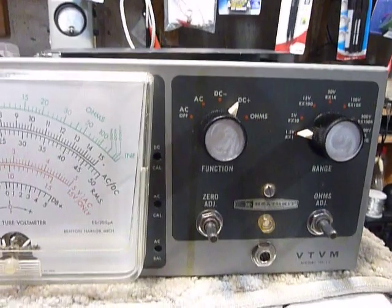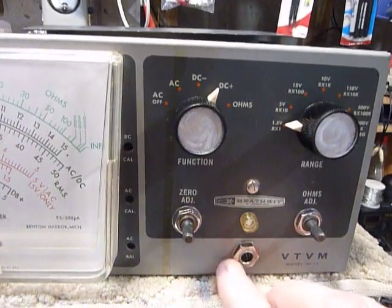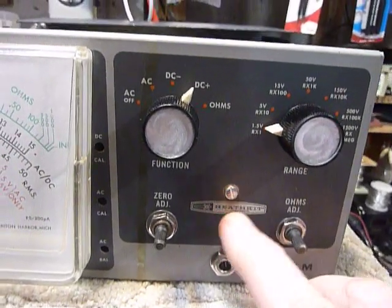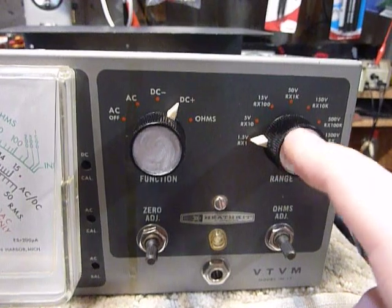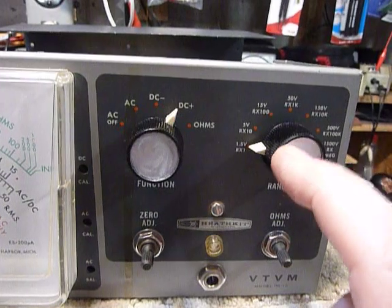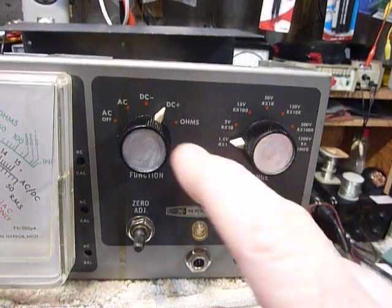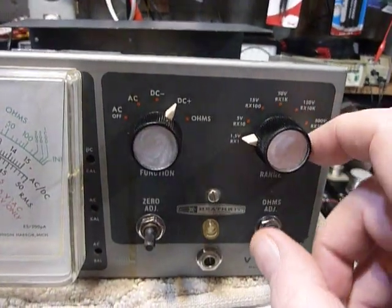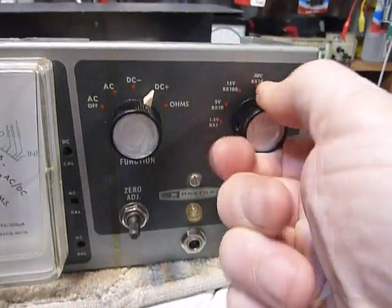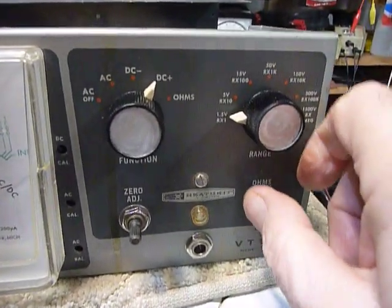I fixed it up and got it working really fine. You'll notice the hardware here is nice and shiny — I replaced the nuts, washers, and screws with nice shiny ones. The knobs were corroded, so I cleaned them up with a very small wire brush on my Dremel mini grinder. They don't look perfect but they look a lot better than before. I then cleaned the switches by cycling them about 25 times on each one.